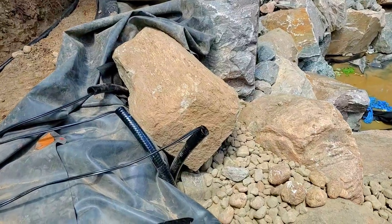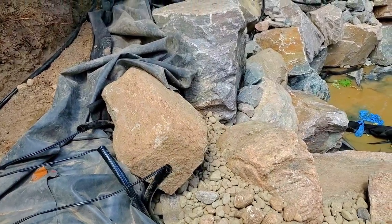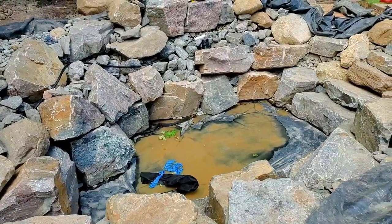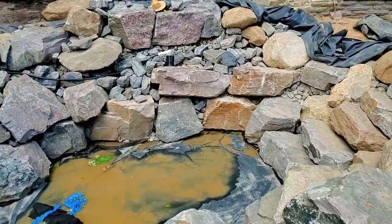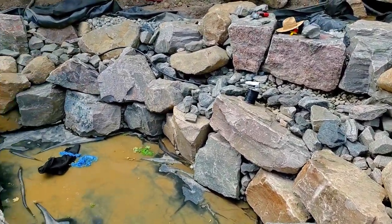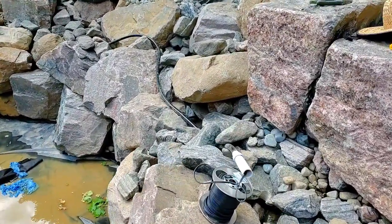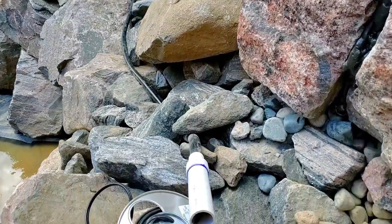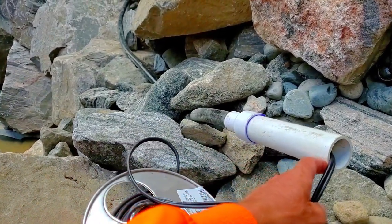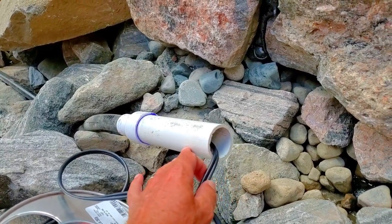with our lighting coming through some 1-inch flex buried in the rock. We're going to tuck away, make it easier if we ever need to rewire or replace these lights. They won't be buried in the rock. Be able to feed a wire through that much more conveniently. See, the guys have snaked through, and then we'll actually install our light into this little piece of 1-inch pipe with some extra wire coiled up behind it, so it's easy to pull out.